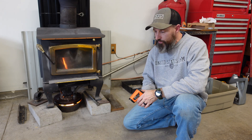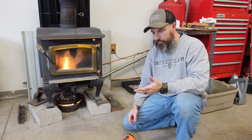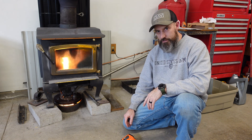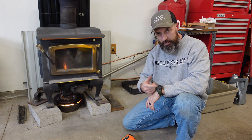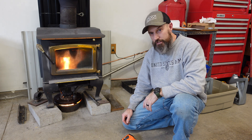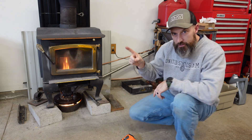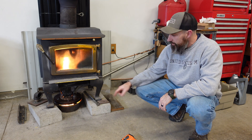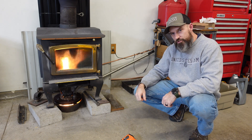That's it for this video. What I found out about putting a little bit of diesel in my used oil: I don't really think it made much of a difference. Maybe a 50/50 mix would have made some type of difference, but I couldn't tell any difference at all. So I'm just going to stick to burning straight used oil with no diesel — except I do use diesel to help light it in the beginning because diesel lights off easier than used oil. Just an experiment — thought some of you guys would like to see that. Watch that next video on what happens if this fan goes out — if it stops putting air in, it's not going to burn the same. Give this video a thumbs up, leave a comment, hit that subscribe button, help support this channel. God bless and stay warm.